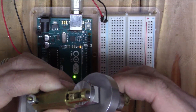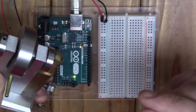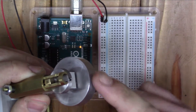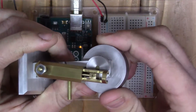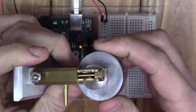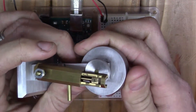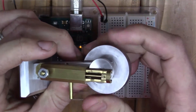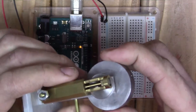The next problem is there was nothing telling the launchpad what position the motor was in. So what was likely to happen is that the solenoid would fire out of time — it would spin in one direction and then the solenoid would fire out of time, causing the motor to spin in the opposite direction. So the operation of the motor would be very erratic.